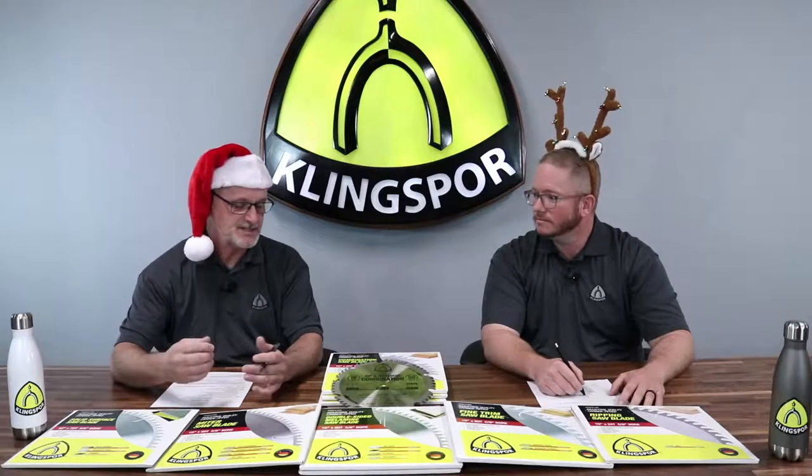We're also talking about high-quality micro grain carbide. In any metal, there are little grains of metal, and the size of the grain is a good indication of how sharp you can actually get that thing. When we talk about micro grain carbide, those are tiny little grains that allow you to get a very sharp edge. In fact, this edge is sharp enough that if I were to push my finger against one of these teeth, I'd get cut — plain and simple.